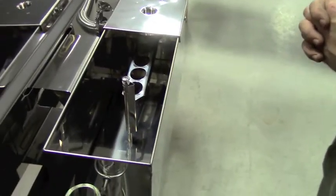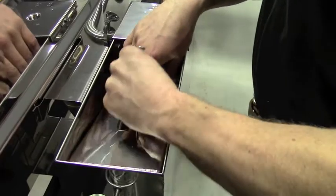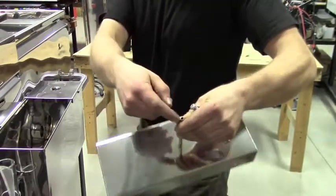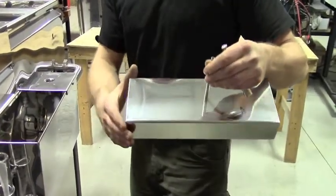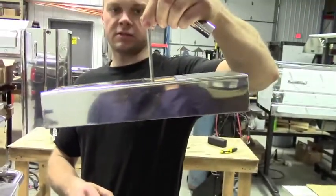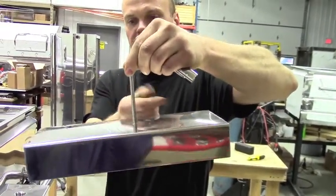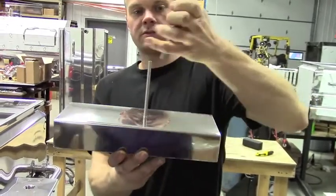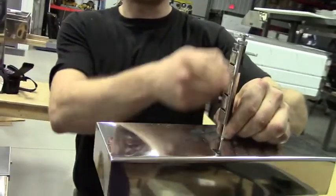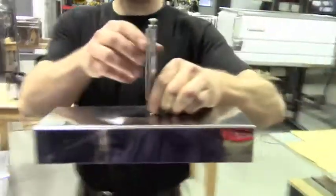So how do you regulate what the depth is? Let's get this float out of here first. That is the float. It is vented, meaning this stem is actually open to the float so that as this float gets hot, it doesn't have a tendency of expanding or bursting. Take note that the stem is not centered — it's located further to one side than the other. That's because when this regulator is on there, the front face of this regulator becomes dead center of the float so that when it's in your float box it doesn't tend to tip one way or the other. It's perfectly balanced.